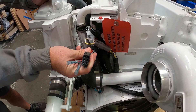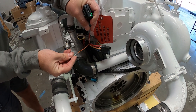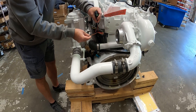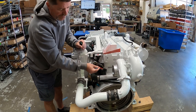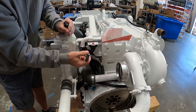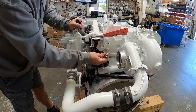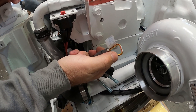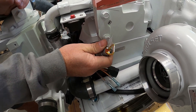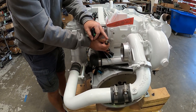Here is the connection point for the on-engine wiring — there's an eight-pin molded connector and two additional wires. A lot of guys ask what those additional wires are for — the answer is nothing. One was provisioned for an energized-to-stop function, the opposite of how this engine works, and the other was potentially for a water-in-fuel circuit. The eight-pin connection runs up to the dash instrument panel and key switch or push button. There's also a connector with a yellow and red wire — this is a loop-over jumper for the crank signal. If you have a neutral safety circuit, you can run these wires to a transmission switch so the engine only starts when in neutral.